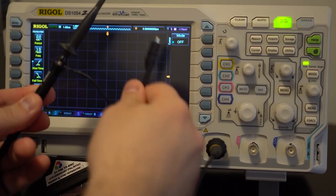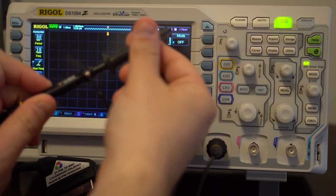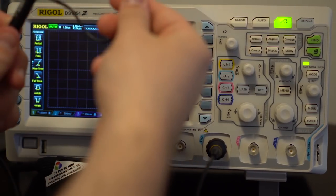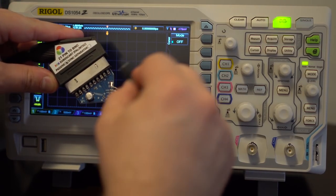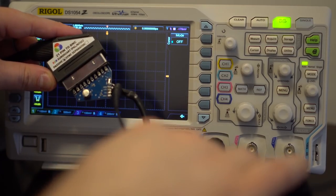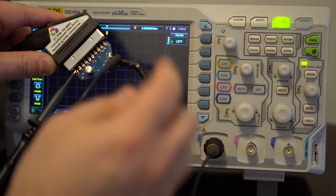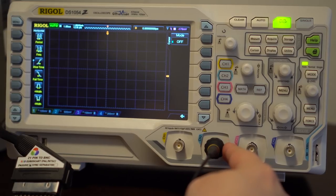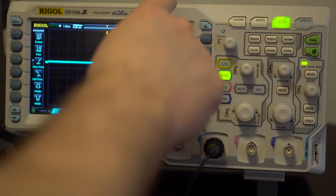So let's start out with the easy part — the probe itself. You could either poke it with just a little pin; I like to leave this on so you could clip it and protect it. And here's your ground wire. Just grab the cable, hook the ground clip up to the exposed ground wire, and then we're going to do sync just because it's on the edge and easy to clip to. My probe is randomly just in channel two, so turn on channel two.